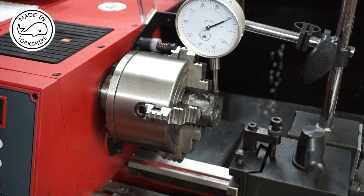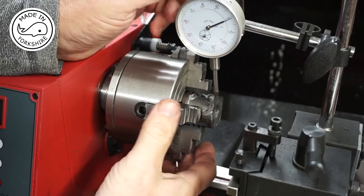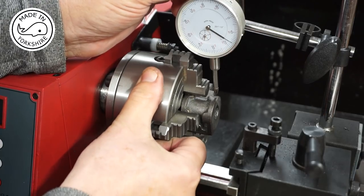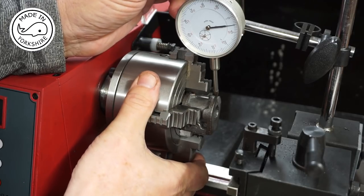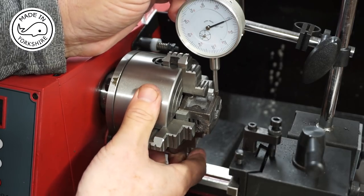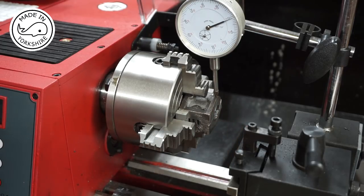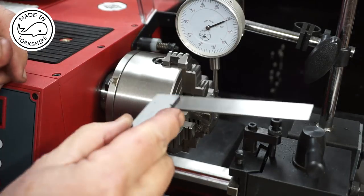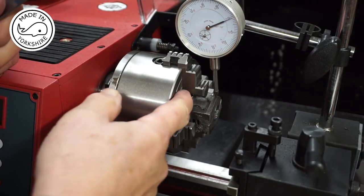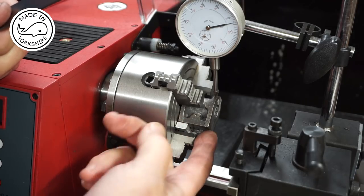I must have spent about half an hour trying to centre this up on the four-jaw chuck, but I think I've got it right now. I've been using the circumference round here with the dial indicator, so that's about on zero, a bit under zero there, slightly over there. I think I'm there. I've also put the indicator on this face and it looks pretty good. In addition, I've used this little set square just to check that all the surfaces are perpendicular with the face of the four-jaw chuck and everything looks good. I've had to put some packing in there to protect the port face.